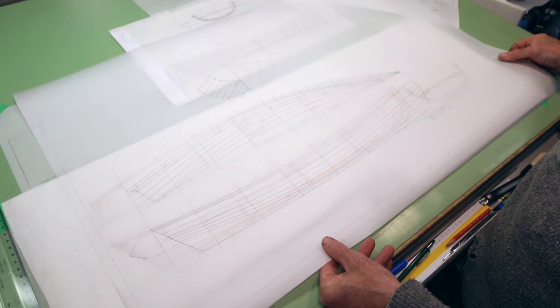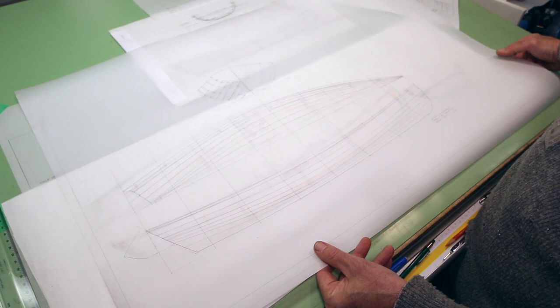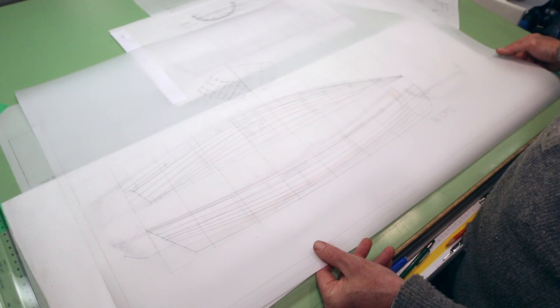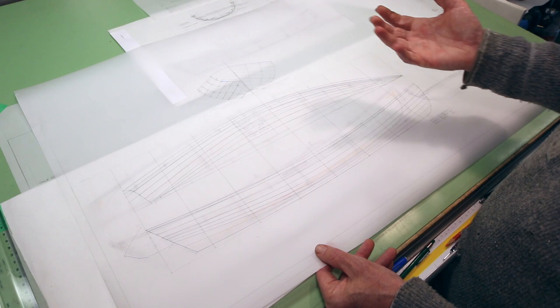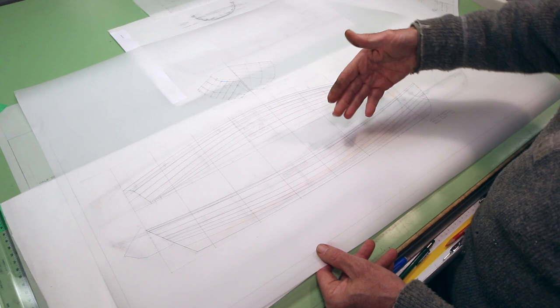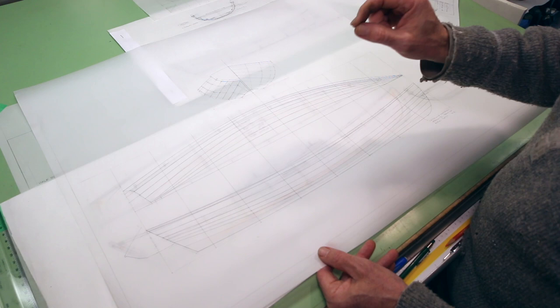And just as I sort of got done this, I was like, you know, there's something about this that is bugging me. Remember how in the last episode I mentioned creating a master grid underlay in order to help prevent dimensional creep? Yep, that would have been smart. And so I sat down and I started measuring a few things, and I realized that we had slowly but surely kind of ballooned beyond some of the basic dimensions we started out with, and we had grown from what was supposed to be like a 4-foot wide boat to something that's like 4.5 feet wide, and it's just like little tiny tweaks: tweak the line here, we'll tweak the line there, and it kept growing and growing.